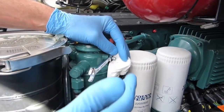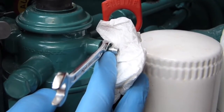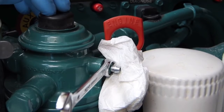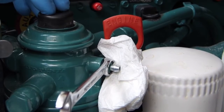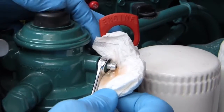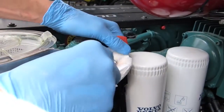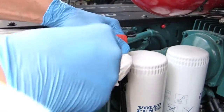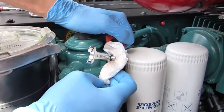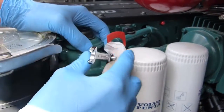The next step is to suck any air out of the system. Our engine here has a bleed nipple on the side and a priming pump on the top. I've spun it over on the starter a couple of times just to bring fuel in because that's much quicker than pumping by hand. Hopefully any air is just a little bit in the top here, so we're going to open it — and immediately you can see there's a little bit of fuel, that's good. Just give a little pump to make sure we've got the air out — there it goes, see that little spurt, that's fantastic. Getting a few bubbles — while it's bubbling just close it all up, and pump on this type. It's going really hard and barely moving now, so the pressure in there is really nicely pressurized.